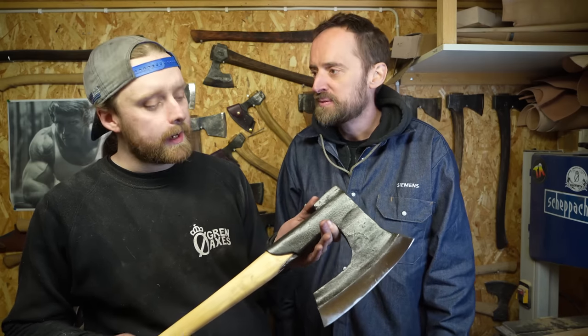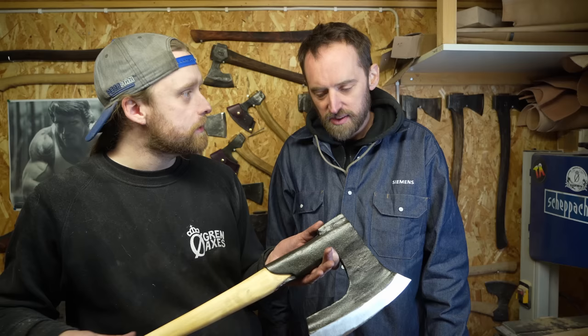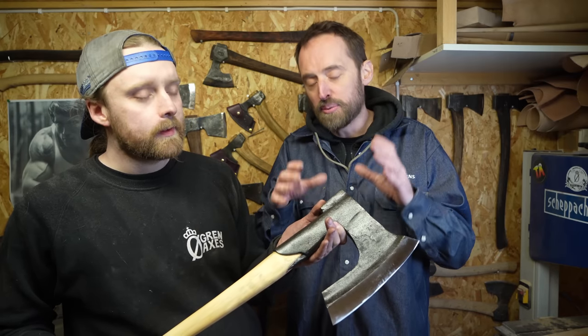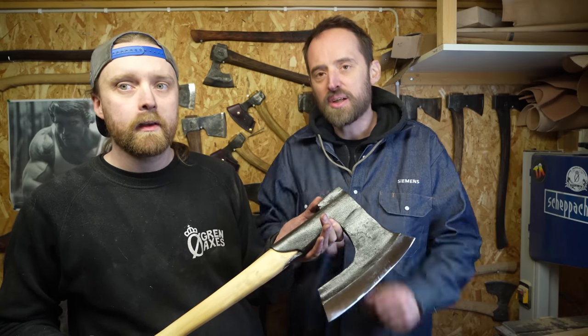And it's also the case that sometimes they didn't wedge it, right? Because they can easily switch handle. Is that a myth or is it true? It's a long, thin taper, so there's tons of surface area and lots of friction inside. So if you broke the handle, you could switch it very easily because you didn't wedge it, and it goes to quite a small end.